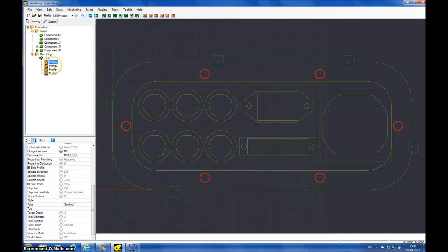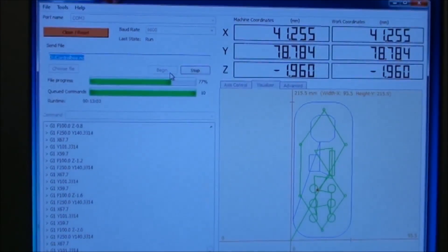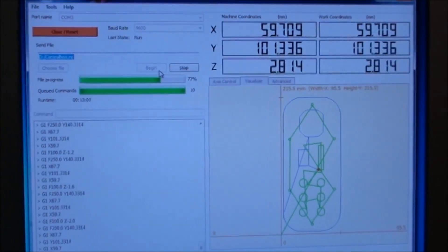I have basically done this for the different pieces — the holes for the connectors, all the connectors, the outer perimeter, and some holding tabs. All of this should be fine. After generating the G-code, I go to the Shapeoko, load the program into the controller, and we are basically ready to start cutting.